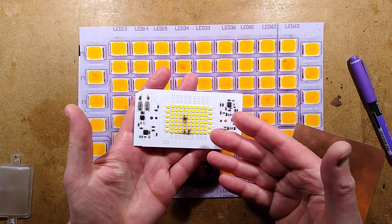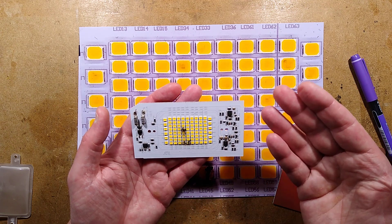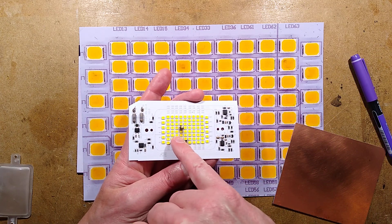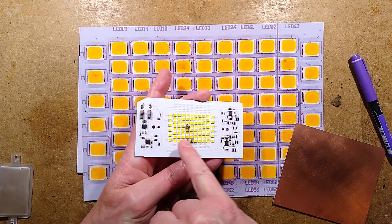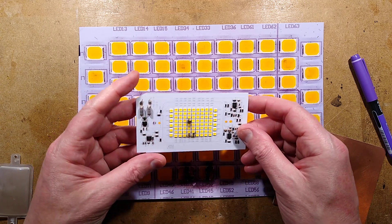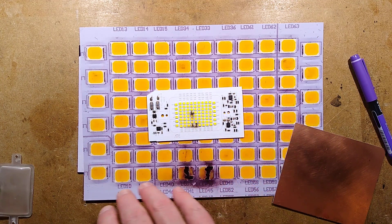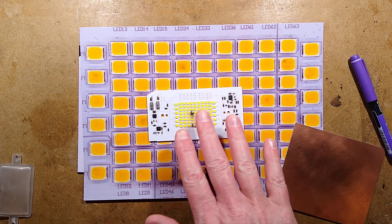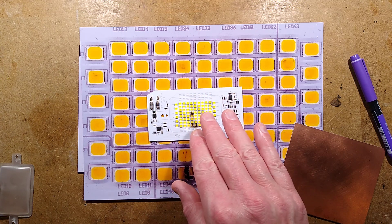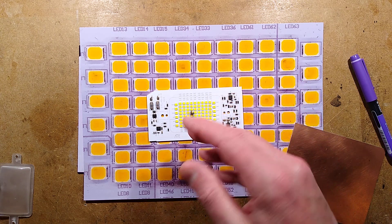Because some of these lights are not earthed properly — there's an earth wire into the light but it's not actually connected to anything, just floating in thin air — they don't know why they do this, but it's very common with grey imports. The bridge rectifier means the current leakage to the aluminium plate will have a DC bias. This is where RCDs that would theoretically pick up that leakage may not, because the circuitry is current-limiting and it won't simply trip the circuit breaker.